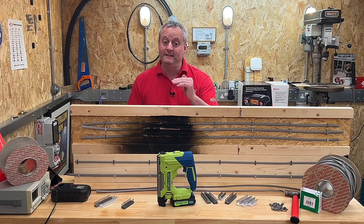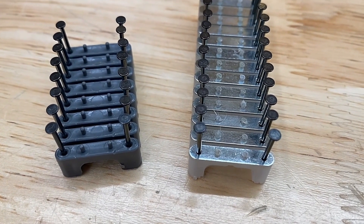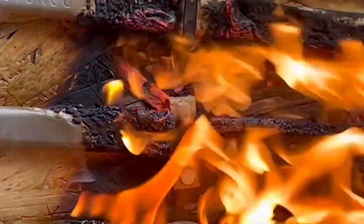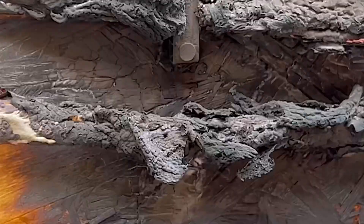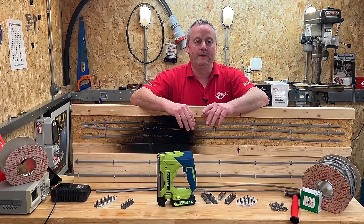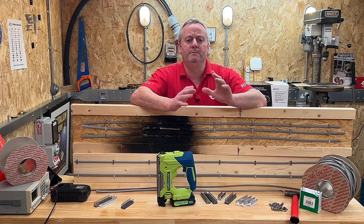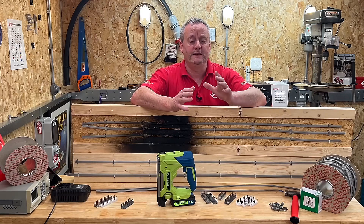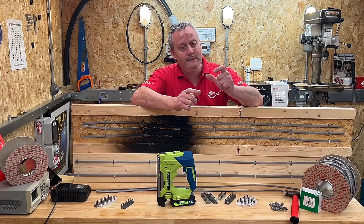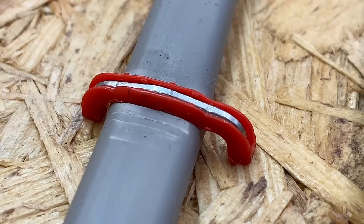The insulated clip means only a plastic part is ever in contact with the cable. It's supplemented for premature collapsing by a metal strap, which can be inserted throughout a run at the electrician's discretion to prevent the wiring system falling down and becoming an entanglement risk. We've also set fire to cables to test it with great results. There are fully metallic clips on the market for this purpose, but with those you have to be very careful — the clip itself can compress the cable and in a worst-case scenario damage it, making the clip live or causing a short circuit.